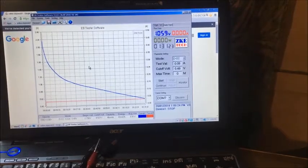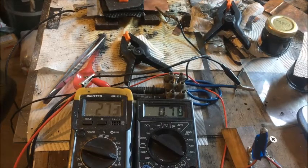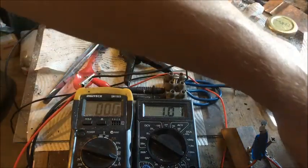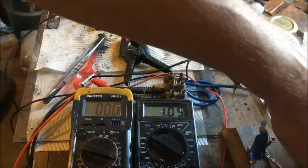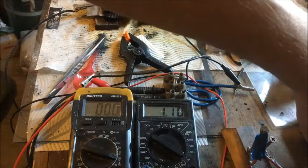We'll connect the motor and see what happens directly after the test. We've got 1 volt there and 1 volt there. I'll connect the load and see what we get. It's depleted. We're still holding 0.7V and 24 milliamps — not too bad. Short circuit: 60mA. So now we've got to see if it declines in power. So 42 milliwatt hours we have to go for.